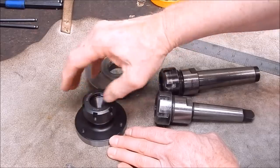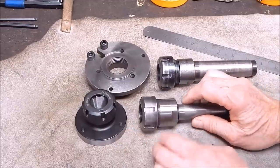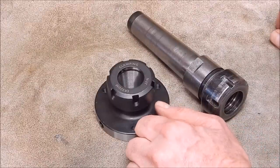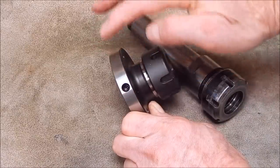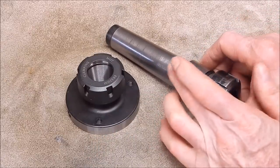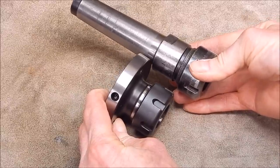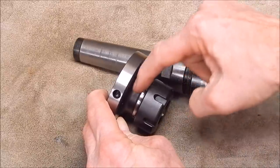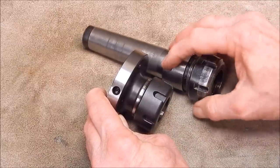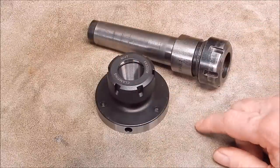It's a good piece of gear. Once it's pulled up everything is going to be pretty rock solid. One thing that's immediately obvious is that you're going to need a pin wrench or C-spanner to hold the chuck so you can do the nut up and undo it without the spindle turning. The regular morse taper type has a flat on the back for that — this one doesn't come with a pin wrench, so you'll have to source or make one.